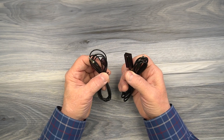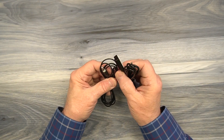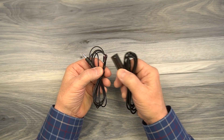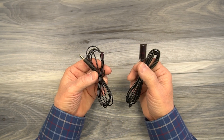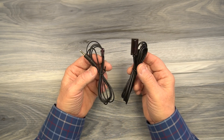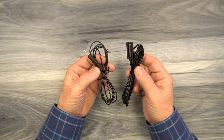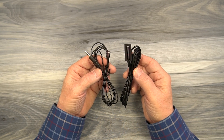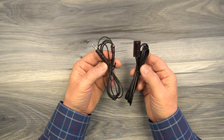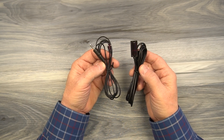One last thing to mention: the infrared blaster kits look very similar but are actually two different styles. One has a larger head and one has a smaller head — the larger head is the receiver and the smaller head is the transmitter. It's very important you plug these into the right ports on the remote receivers and on the transmitter: the larger one into the IR in port and the smaller one into the IR out port for proper operation.